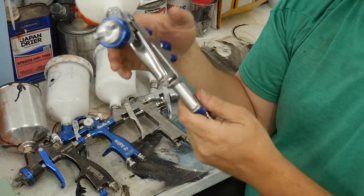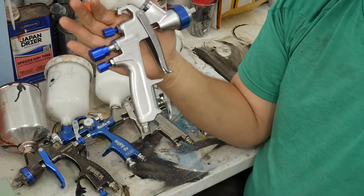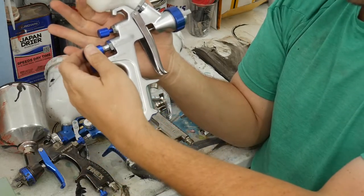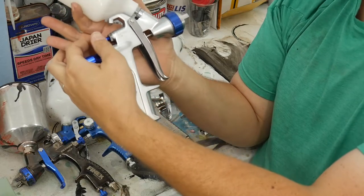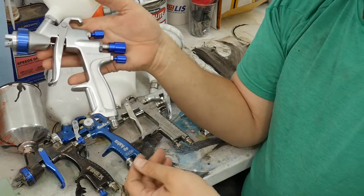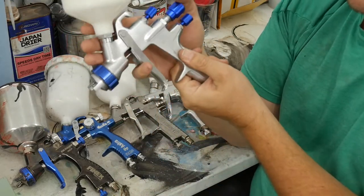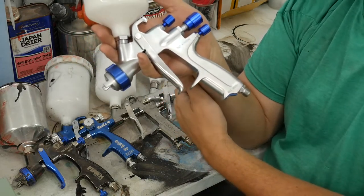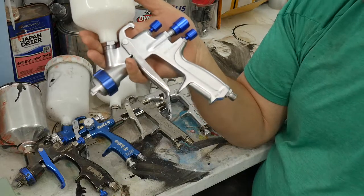You'll have to go above 35 PSI to get a good pattern, which is a problem. One thing I do like is that the pattern, fluid, and airflow knobs are labeled — handy for beginners. But most of us know you crank the fluid out, run the airflow all the way out, and your pattern and regulator are really the only things you'll tweak. Having it labeled is fine but it doesn't overcome the gun's shortcomings. The price of about $80 is too high — do not buy this gun at Lowe's. Go on Amazon or buy a good gun from a professional auto body shop.